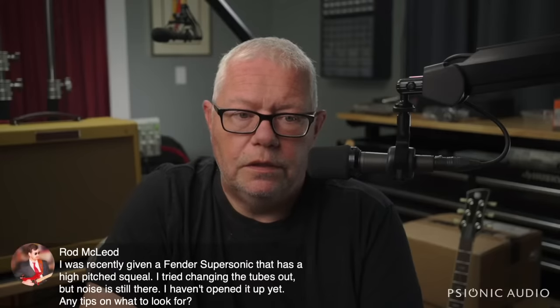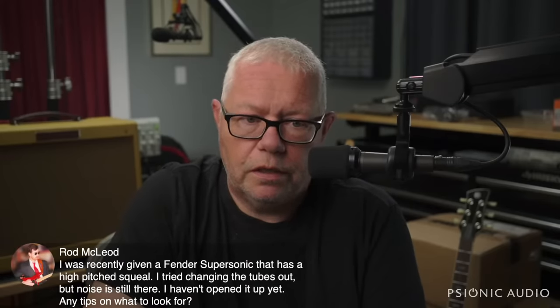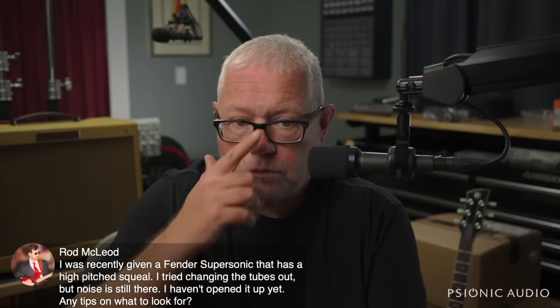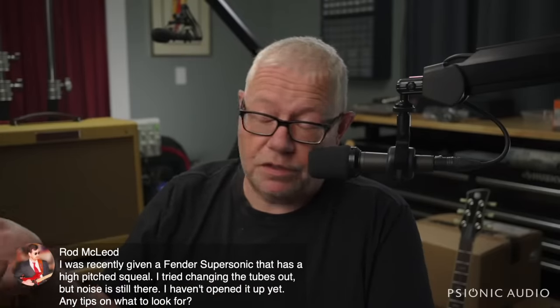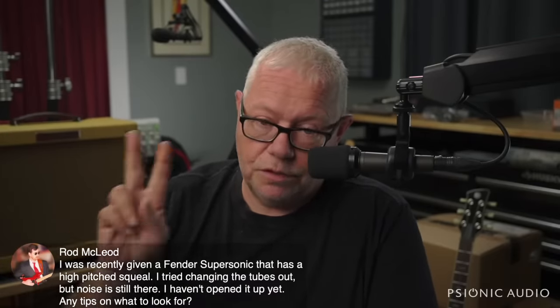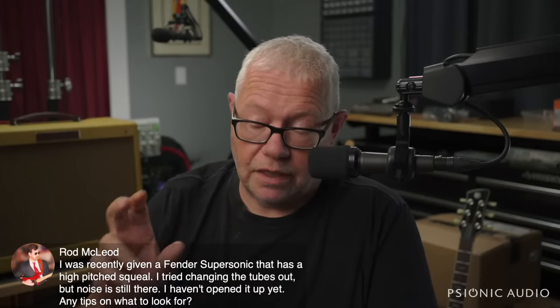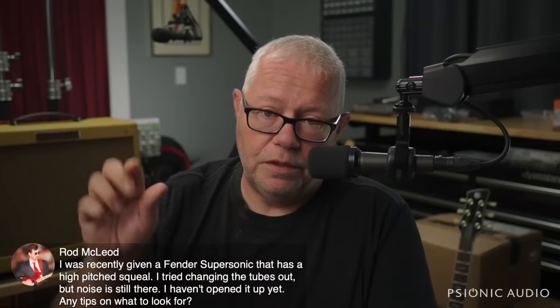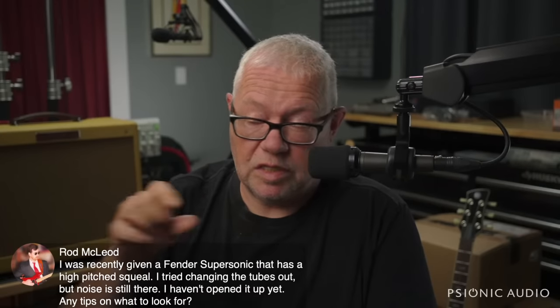Hey, Rod McLeod. Sorry, I have to be the bearer of bad news on the Fender Supersonic, especially the high-pitched squeal. If you look at my Fender reissue videos and my Fender Deluxe and Blues Deluxe and DeVille videos, you'll see that I mentioned two things repeatedly. Those IC brand filter caps fail all the time. Input jacks and pot solder connections like to break on those PCBs.